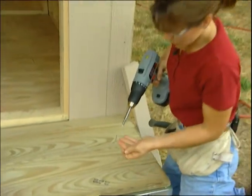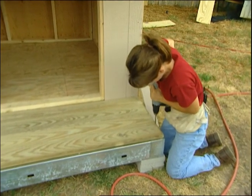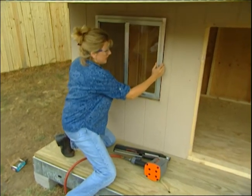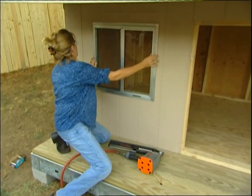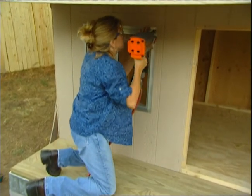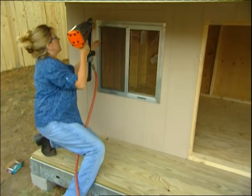For our porch, we're using treated 1x6s. Because the lumber is treated, that makes it water resistant. We're also ready to install the window, and this fits right into the pre-cut opening. Make sure that the edge of the window is parallel with the channel in the siding so that it's plumb. I'm going to use my nail gun to nail this in place at the top and down at the bottom, then do the same thing on the other side.